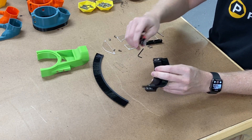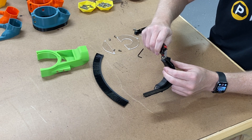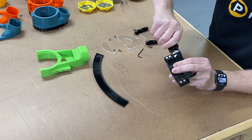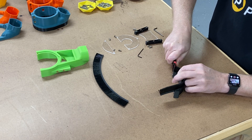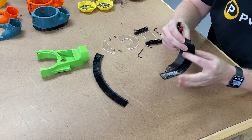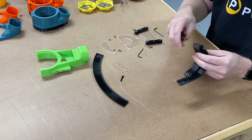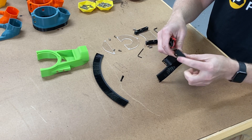Take my knife, put it right up against the edge of the plastic piece, and wiggle the tip of the knife right into the bristles so it comes out flush on either side. Then gently rock it back and forth with it sitting on the table — that cleanly cuts it off. I may need to go in and do a little more gliding since you are cutting into the brush material. It may take several swings, but you want that brush sitting flush right on the edge.